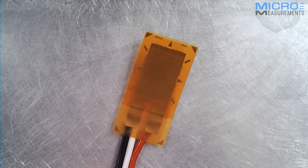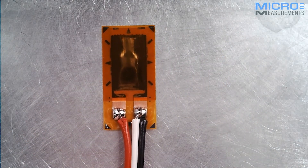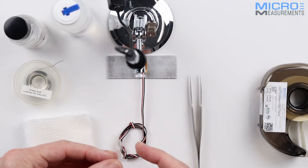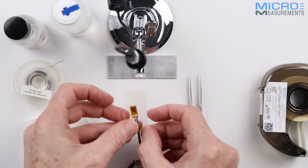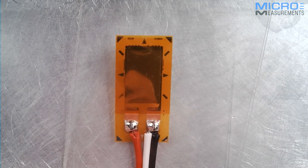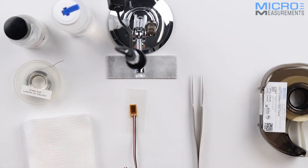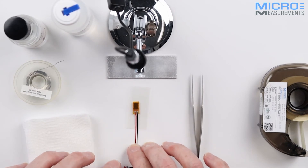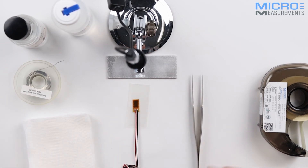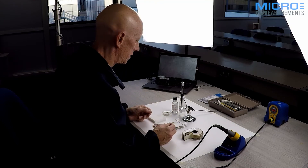You can see there's absolutely no damage from the solder heat and the solder pads are all nicely cleaned up and ready to bond onto a structure. Alternatively, you can place the gauge back into the acetate to store it — ready to transfer to site or put back in the pack to keep it safe. The beauty of pre-leading is that you can customize the lead wire. I've used 330 DFE here, but you can use Teflon lead wire or solid copper wire for specific requirements — for higher temperatures or more convenient applications. It's very quick and easy to do under a nice workbench with decent lighting.